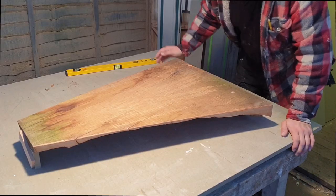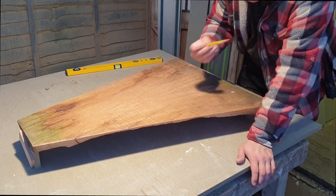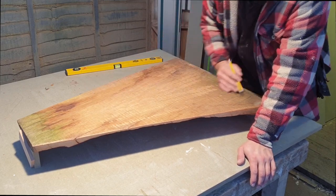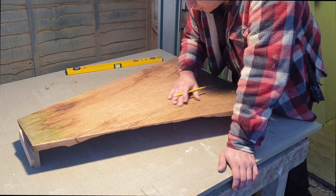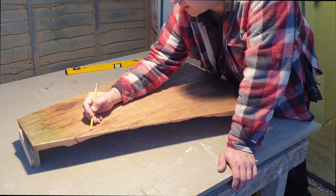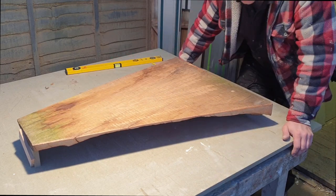We've cleaned all the edges to a fashion. I've decided what I'm going to do is make my own sort of natural live edge to these straight pieces. These cracks I'm not too worried about — they don't follow through, they're just surface so I'm not too bothered. This one's going to need some sort of bow tie or tie in it, and this one as well, so I'll probably do a couple — just one down there for aesthetic reasons.